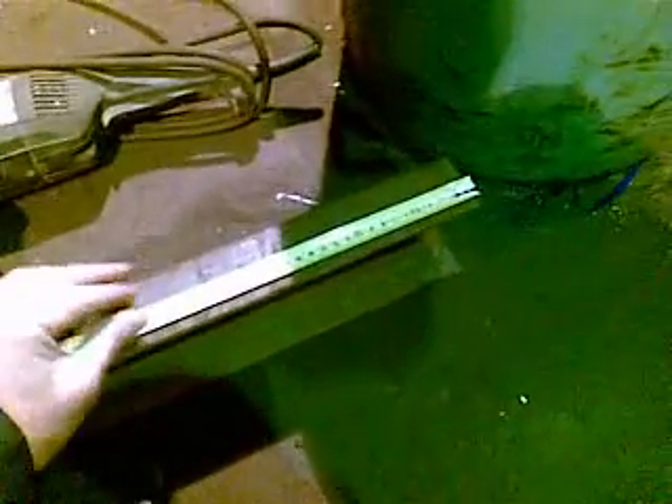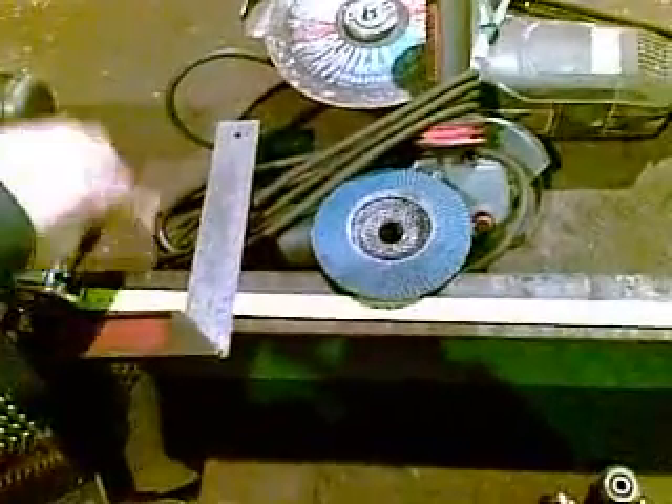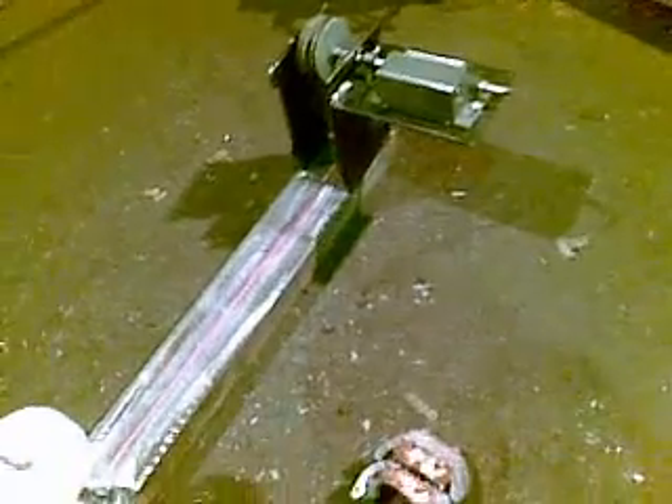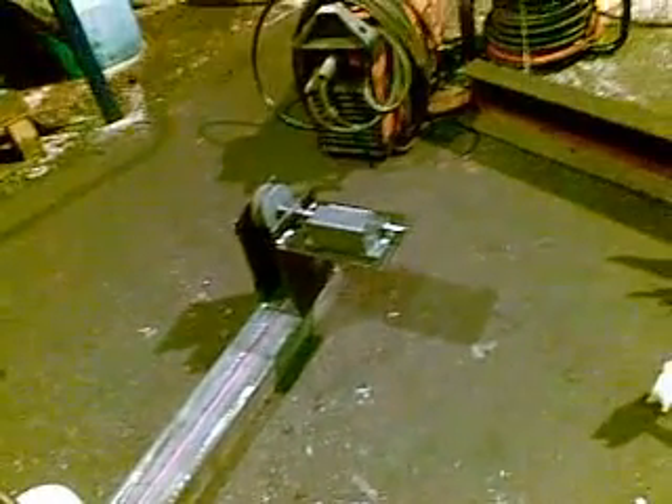First I'm going to start with the frame. This big chunk of metal - quite usual thing to find around scrap yards. This piece is 70cm long, which is this bit here. You could get other pieces of metal from the scrap yard to make your frame, it's quite a simple thing to do. If you cannot weld or you don't have a welding machine, you could bolt it all together with nuts and bolts, but do use a lot of them to keep the frame as solid as you can. You're going to need that solidity because you're using so much force when you're winding.